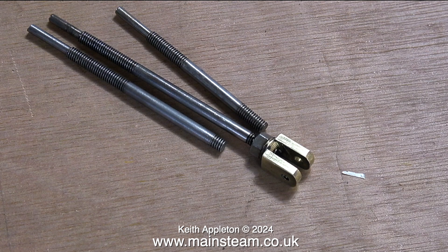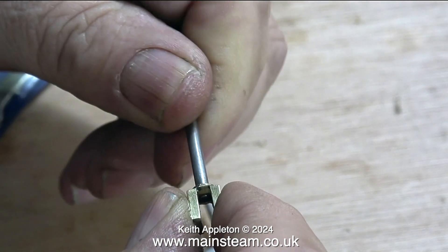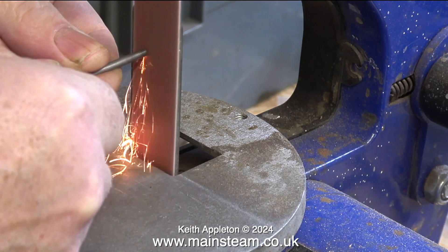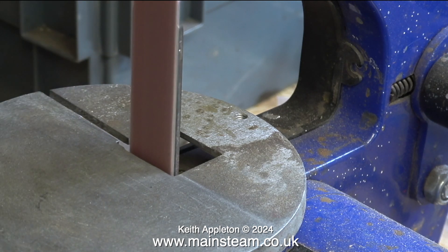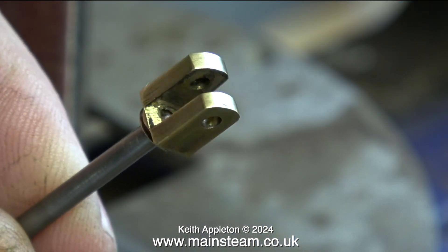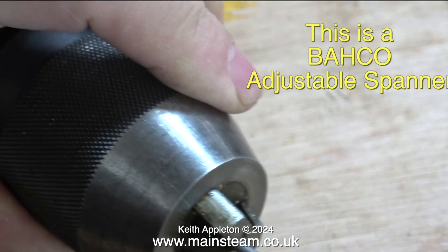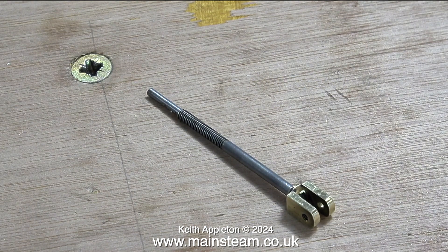This clip shows the new valve fork fitted to the old valve spindle supplied with the engine, along with some extra valve rods. The one at the front of the image is the one I'm going to use. As you can see, the valve spindle is just a little bit too long — I don't want it to stick through and foul the expansion link. So I'm using my one-inch belt sander to shorten the thread very slightly so that when I put it back together everything should be a perfect fit. Here's a good tip: put the spindle in a drill chuck and use a bar or spanner to tighten the valve fork or clevis onto the spindle.